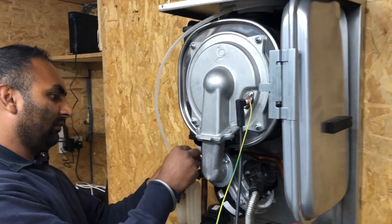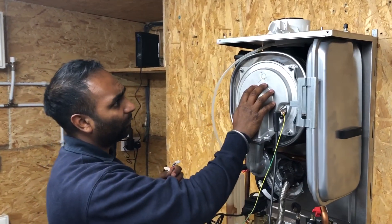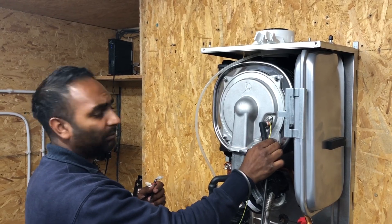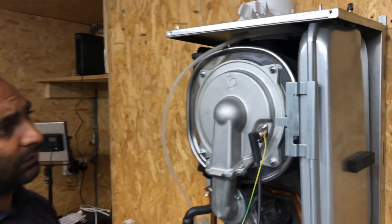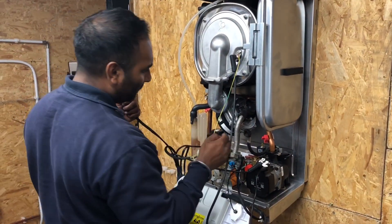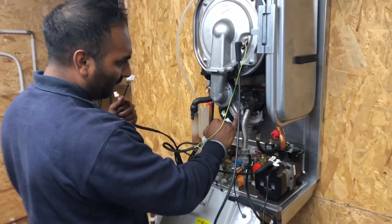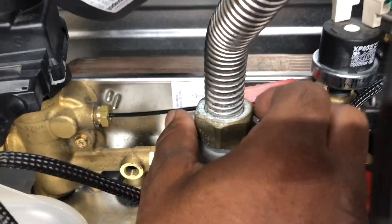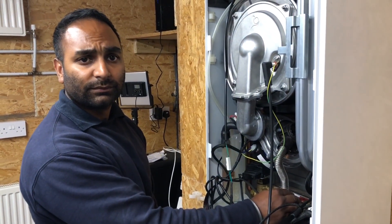So what's that piece you've just put in? This is the burner — that's the burner door. Most important is the seal around here, to ensure that these bolts are equally tight so we don't have any spillage or leaks out of here — which we'd be checking. Then down here we've got your fan. And this is your gas pipe — very important to make sure you've got your washer and it's fully tightened. Tighten it up, spray it, test it, make sure it's not leaking gas.